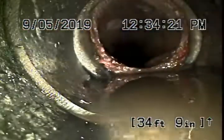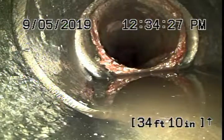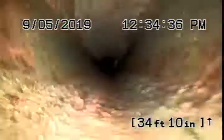It comes to the bathroom now, right where it connects to the old cast iron pipe, just before the pipe exits the house in the bathroom at the back, underneath the toilet. This is very poorly connected — they probably used a rubber band instead of a no-hub coupling, and that's why the pipe is sinking here. That's not good and can cause a problem.